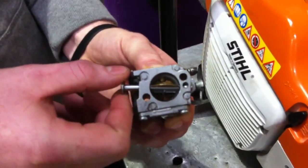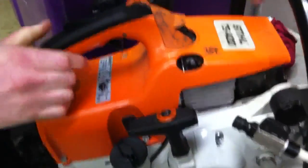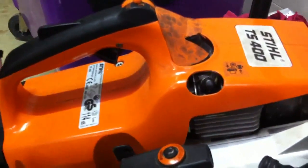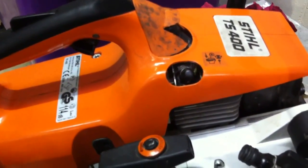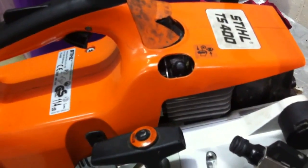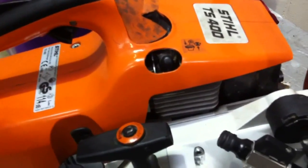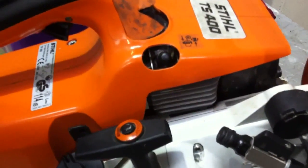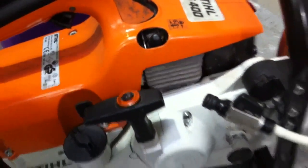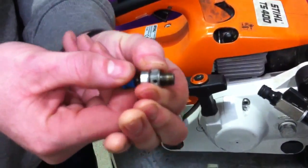In addition, this machine is also equipped with a decompression button. The purpose of the decompression button is to relieve compression in the cylinder when the operator is trying to start the engine. It allows the operator to turn the engine over faster, meaning any heat generated by compressing the air has less time to escape to the cooling jacket and is available to aid cold starting. There's the actual button, and you can see it operating on and off.